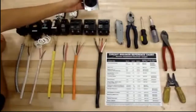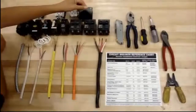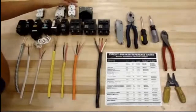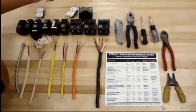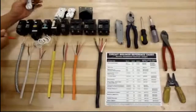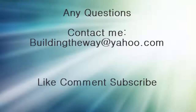Now what we have here is the type of plugs to use for the breakers and wires. You have a 30 amp going into this kind of plug. For the 20 amp, you can tell right here on the side — that's how you can tell it's a 20 amp. Same thing here with the GFI. The GFI is mainly for kitchens and bathrooms. And the standard 15 amp — notice there's no little line — is for the 15 amp breakers with the wire. Thank you so much.